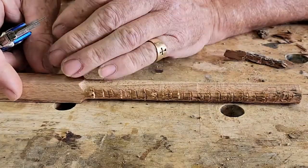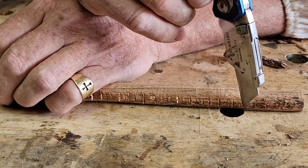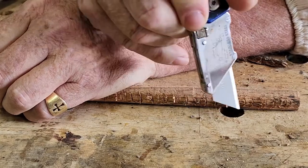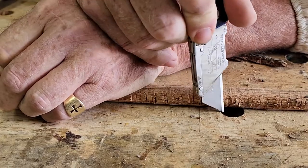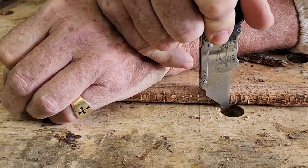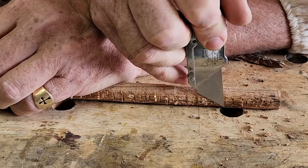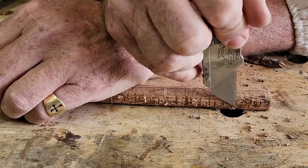Now, I made a little small model. If you come in with your broad axe and start making these cuts, chop, chop, chop, then you'll get your axe and you'll start cutting those chop marks out. Again, you'll chop down. I'm just using the razor blade so you get the idea. And once you cut those chunks out, your log actually starts becoming flat. You start cutting all those pieces out that you came down with your broad axe, and you'll start getting almost one flat side on your log.